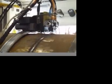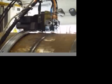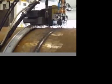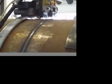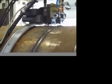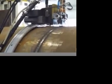It's a very interesting process. What's the next step after you get this done? When you get a cap, pull the floor and move it to the next one. The guys will come around and coat these joints. See, this pipe's not coated. They'll bump these welds off. They'll UT it. The coating will come through. Blast it. Coat it. This is ready to put in. Then it gets tested. It'll be X-rayed or UT before it's ever coated.